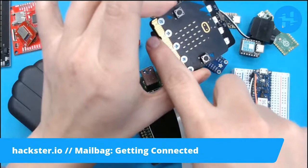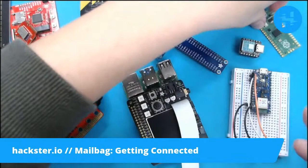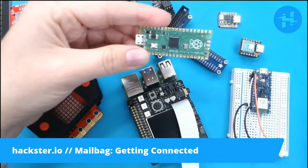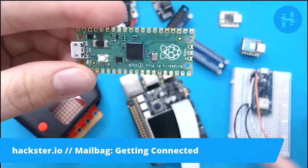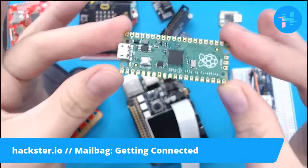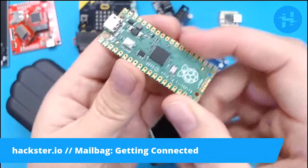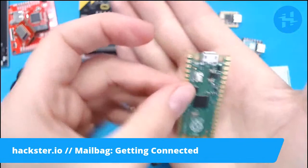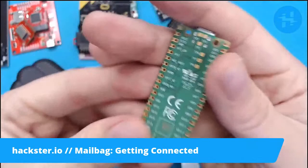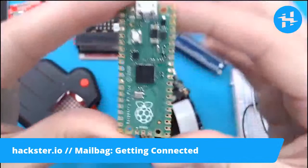This is the servo kit from Pimoroni, and it's got one of the new micro:bits on it that actually has improved connectors for alligator clips. But it also kind of fits into a couple of larger trends we're seeing lately, where you have things like the new Raspberry Pi Pico with the RP2040 chip — custom silicon by Raspberry Pi. This one is very much designed as a component — a microcontroller in and of itself — but their real dream is that you'll be able to embed this into your own technology. There are aspects that reflect that: these castellated edges mean you can lay it flat on a PCB and use solder pads to connect it. And also enabling that is this flat bottom — there are no components mounted on there, with spots to expand if you want, but it's very easy to stick onto your PCB.